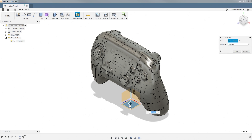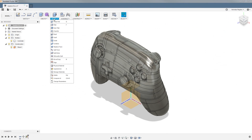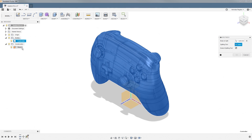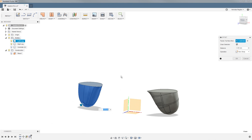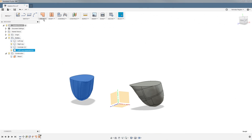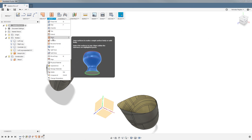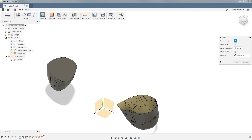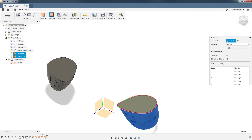After seven or eight prototypes, I settled on trying to have the controllers packed together tightly while standing up, so I was going to need a couple of leg cups. After splitting off the parts I didn't need, I wanted to add an extra half millimeter along the inside of each cup so the controller's fit wouldn't be too tight. That's exactly what the patch menu's offset command does. I ran into a repeatable crash when I tried this without smoothing the screw holes first — Fusion 360 didn't like offsetting the sharp, concave holes. Once I offset each side, I needed to make a new lid and stitch it together to turn it back into a solid. We'll be able to use these expanded legs later to carve things out.